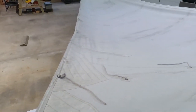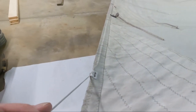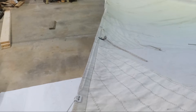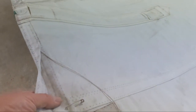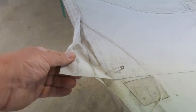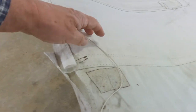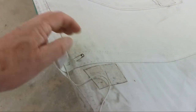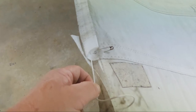I wanted to show you the leech line. You can see here that there is a string attached, and when I pull that it will take that leech and actually curve it in more — see that? That string runs through the folded edge for the hem that was put in the leech of the sail, where they cut it extra long and then folded it over, fold it over again over top itself, and sewed this string in there so that you can pull it.